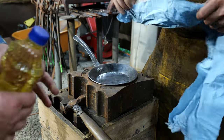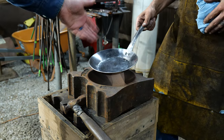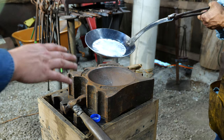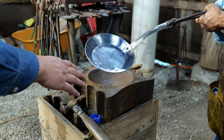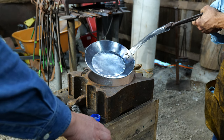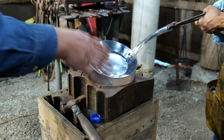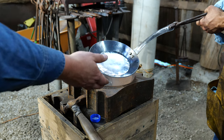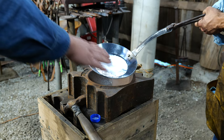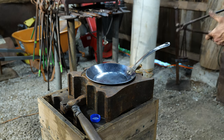He's going to get it hot in the gas forge — if you've got a coal forge or a wide open gas forge, you can do it in either. We definitely don't want to get any color in the pan. We want it to have a nice dark finish where it's just started to heat up, but we don't want to take it to a point where it's got red in it. If it turns red, we've gone too far and we're going to get scorching in one area. So just set it on the swedge block for right now and let it cool down.